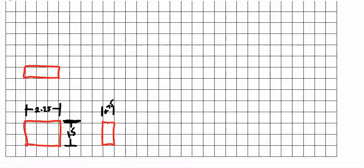Go over here to the height. Well, it's the same height. It's the same dimensions there. So I've done my height, and I've done my width. What haven't I done yet? Well, I haven't done depth. All right. Well, depth would be up here, but if you notice, that and this are the same. So if I go up here and say that this is 0.75, I'm doing a repeat dimension. I don't want to do that. Likewise, if I go here, that's 2.25. That's a repeat dimension. I'm double dimensioning. I don't want to do that. I'm done with this one.